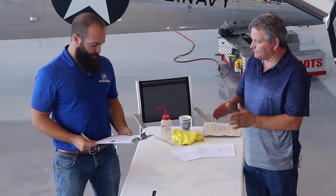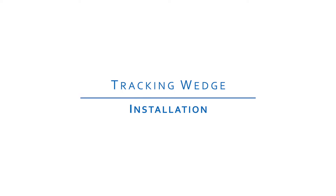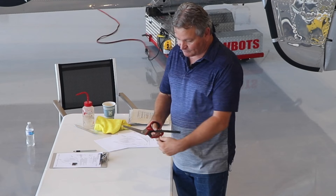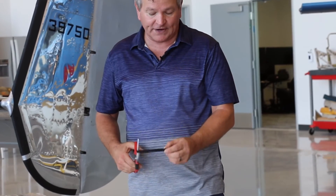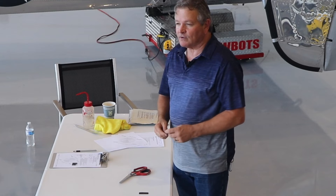Installing the four-inch piece on the blade — do I put it on the center line of the mark? Right. You will center the four-inch piece first, and if we find that we have to add more, we'll split that in half and add it to either side of the already installed pieces. We're going to take the wedge from the kit, which is marked in one-inch increments, cut out four inches, and save the other two. Then we'll go up and install it.